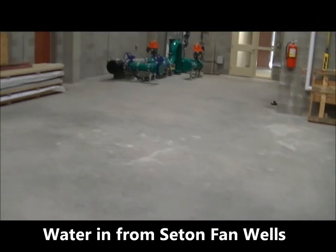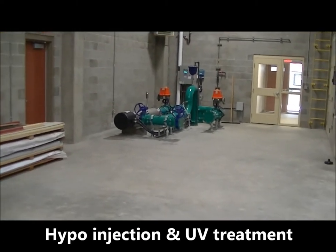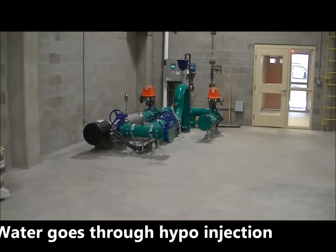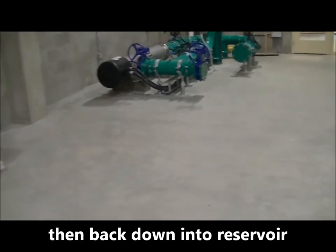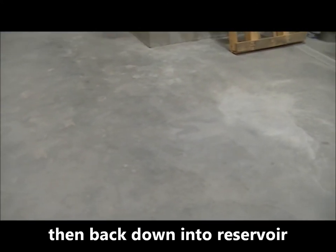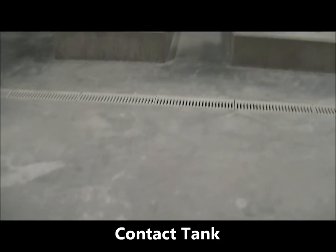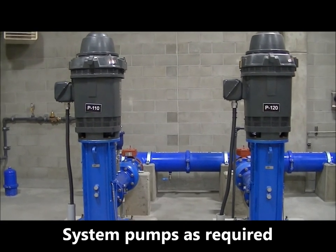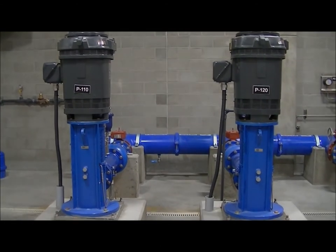The water runs through the lines we just looked at. It will receive hypo or chlorine injection, then go back down into the reservoir below us. Before it goes out, it will also receive a UV treatment. The contact tank below takes on the water for about 45 minutes of contact time before it is released. Then as the system needs it, the reservoir is drawn down a bit and it is time to start pumping up to the million gallon reservoir to keep it full. The treated water, after contact time and UV treatment, goes out through the pumps here.